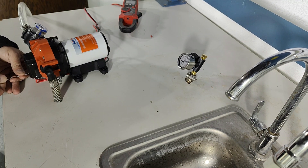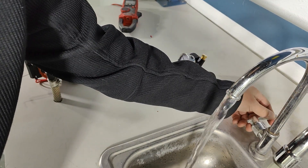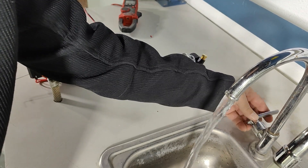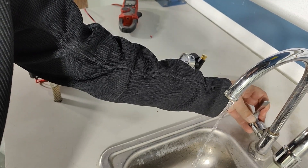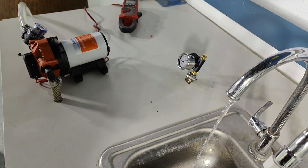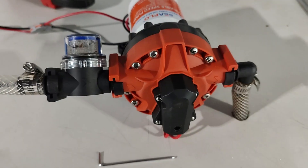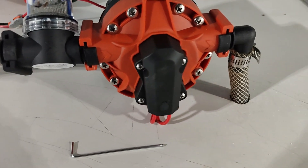So what we're doing now is closing the bypass valve. I did one turn and we'll try on and off — now it's good. I'm running a trickle to see that we're not cycling but it still turns off. That's where you want to be. And when we're all done we just put the rubber grommet back in place and we're good to go.